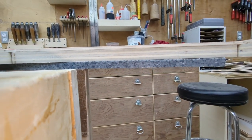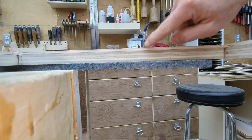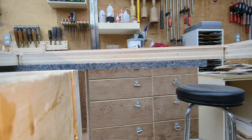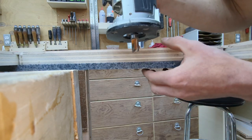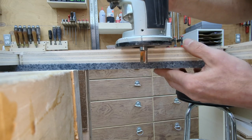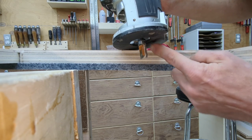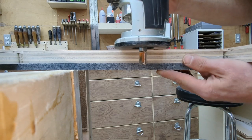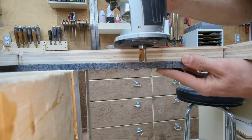And you want to end up using a piece of spacer wood, like you see here. I ended up gluing this spacer ring around so that when it sits on top of my countertop and it's time to make my cut with my pattern bit, that spacer essentially allows this to be positioned so it's cutting to the right depth. If the spacer wasn't here, then by the time this little bearing could register on the template, this would have plunged all the way through. So you want to make sure that your trim ring or your template ring is the proper thickness.